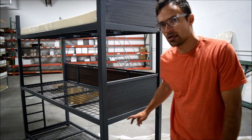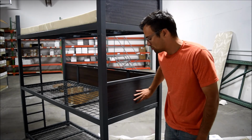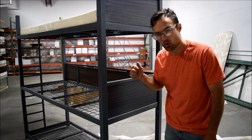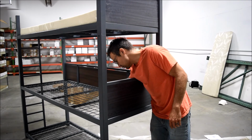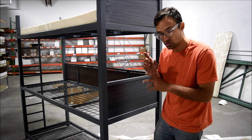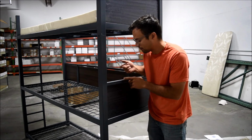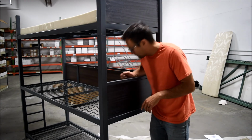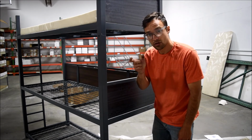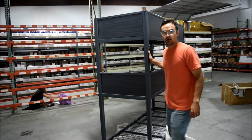It might be a good idea before you anchor these boards in place to use a little hole drill bit to drill pilot holes in the center of these metal holes. Drill a little pilot hole so that it's easier for the screw to stay in place. It's kind of hard to hold in place unless you're really good at it. But for me, at least, it helped to drill a tiny little pilot hole and kind of holds that screw in place. So we're at about the halfway point.